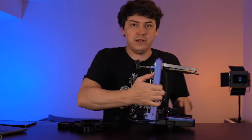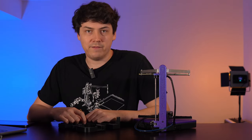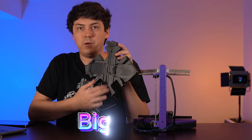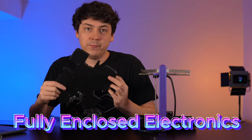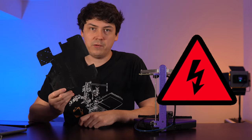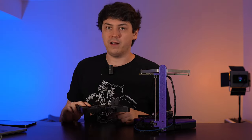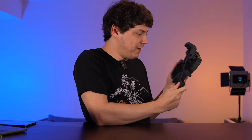Speaking of modifications, there's no longer any drilling of the Z axis rails. Less metal cutting is great, but if you already modified your rails, don't worry — it's fine. It was also trivial to add stiffeners around the Y axis, bulking up its thinnest point. The cavities for the PSU and the SKR Pico now have a bottom to them, which solves the whole naked high voltage circuit board issue. I also changed the wire channels — going from trapping your wires to having them on the top surface, so you can gut your Limitron without soldering. All of this just from fixing one bad decision. What better way to tell you're onto something than when things just start going your way?